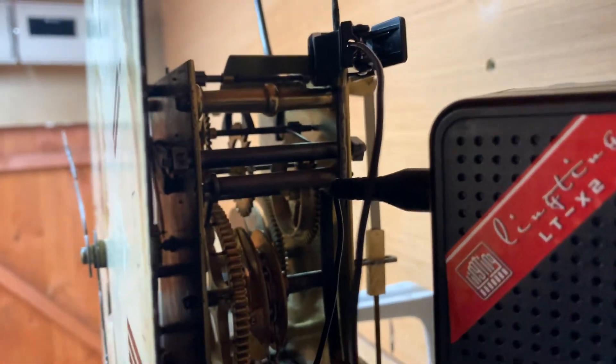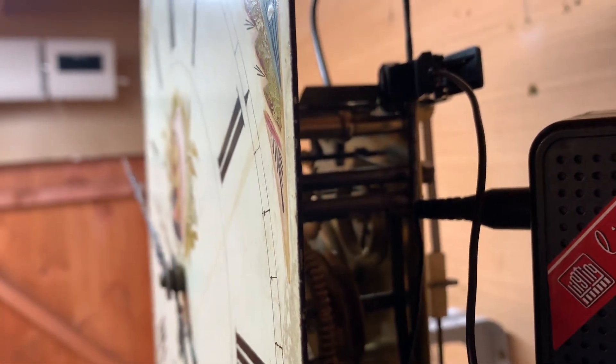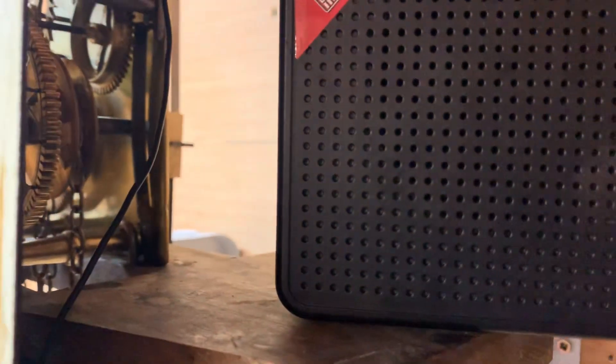That's a 30-hour painted dial clock — I'm thinking around 1750. Just to clarify what I've done with the guitar amplifier: I've just clipped it onto the movement. Obviously it's by the fly at the minute so it would stop it striking if we went to strike, but you put it in a place where it's out of the way of any of the mechanism and you'll pick it up. Sometimes you can put it on top of the dial. It's just enough to isolate and amplify that sound and gives you a good chance of getting it pretty close to being in beat.